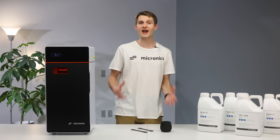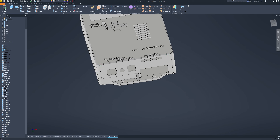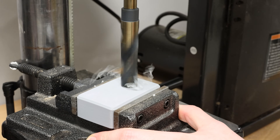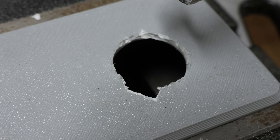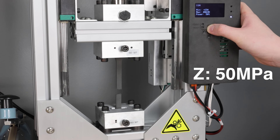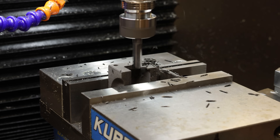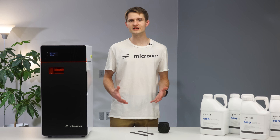Now let's talk about something you might not have considered — the ease of modifying printed parts when prototyping. No matter how skilled you are in CAD, there are always times when you accidentally modeled a hole too small or made a flange covering a screw head. And if you've ever tried to drill it out, you're looking at hours for a reprint just to test again. Here's where SLS steps in with a big advantage: these parts are equally strong in every direction, about 50 megapascals, and they don't have weak layer lines that split. Need to drill a big hole into a thin wall? Done. Need to machine something down? Done. SLS allows you to quickly test your proof-of-concept models and move on to your next iteration.